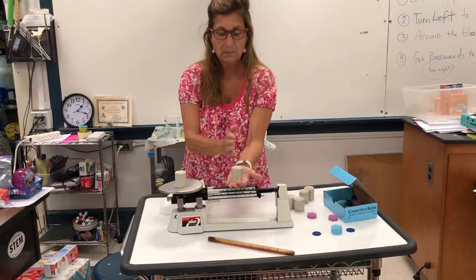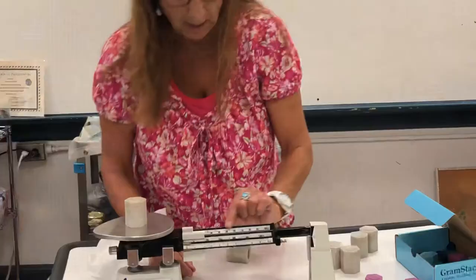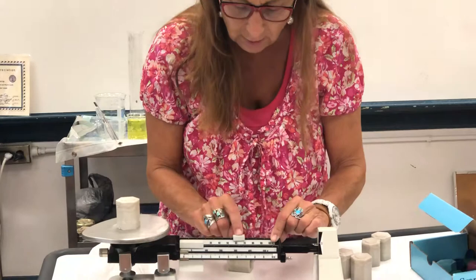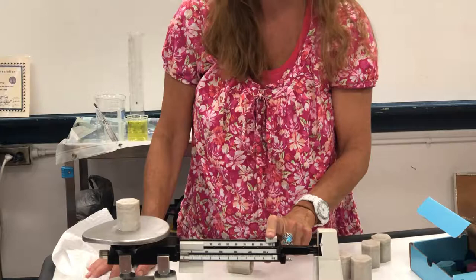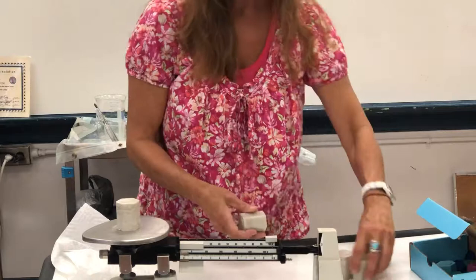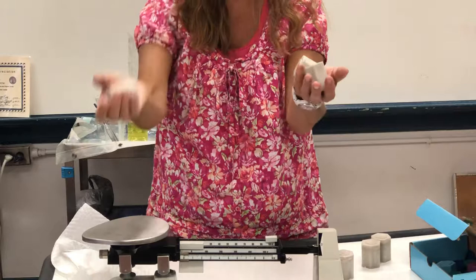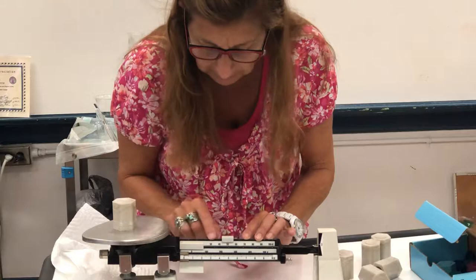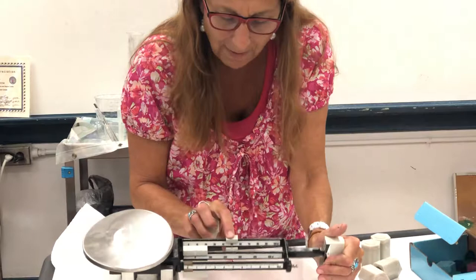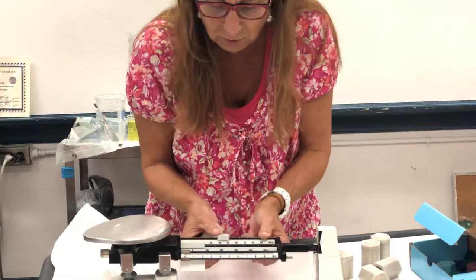Since this is 50 grams, I would actually have to use my top beam, which is an increment — this mass right here is 10 grams, so 0, 10, 20, 30, 40, 50, 60, 70, 80, 90 — if I move that mass all the way to the side that would be equivalent to 100 grams. So what's happened to my balance when I put 100 grams there? It would be like this, wouldn't it? So what I really need to do is move my mass on this beam back to the 50. On the top of each beam are small indentations that the mass actually rests in, and it's important that you get to the place where the mass drops into the little resting spot.